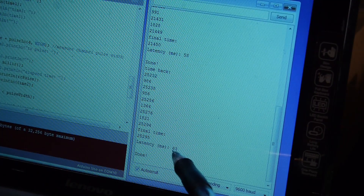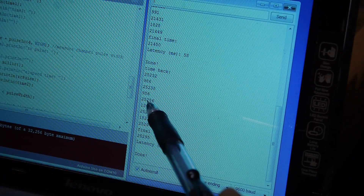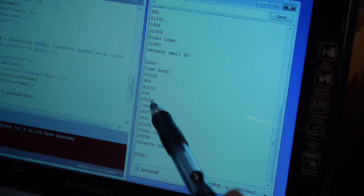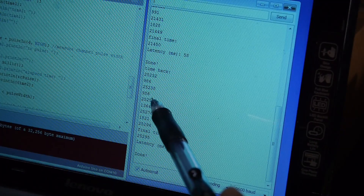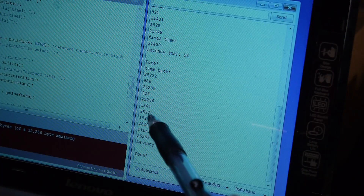So instead of having a latency of 63 milliseconds, we're really talking about 24 milliseconds at the point where we start seeing movement. If you look here at where it actually starts moving a little bit, we've gone 24 milliseconds. So that's actually a very fast response time, especially considering this is a budget price radio. I'd say that's really good on the latency measurements. I'm making a few assumptions in that the transmitter, not the receiver, is the main source of any delays in control response, but I'm pretty confident in my overall measurements. The results place the TTX850 within the same or better performance as most other name brand transmitters, and I think that's pretty impressive for a budget radio like the 850.